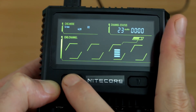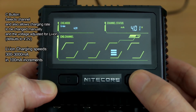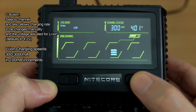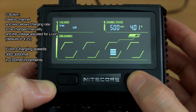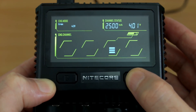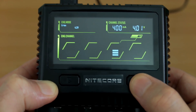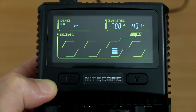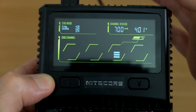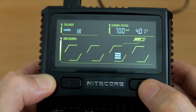Unfortunately there's no per-channel voltage display — it only gives detailed readings once you cycle through the available channels. Pressing the C button lets you cycle through charging speeds. These go from 300 milliamps up to 3000 milliamps (3 amps) in 100-milliamp increments, giving a fine level of control. Whether you need that high charging speed depends on the battery type, but for heavy users of large high-capacity 26650 lithium cells it's a very useful feature.